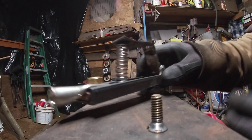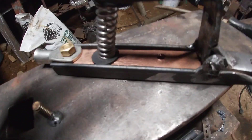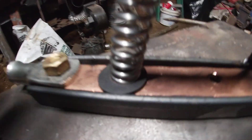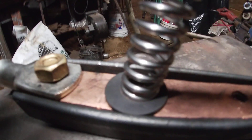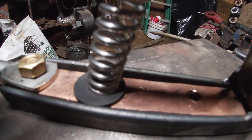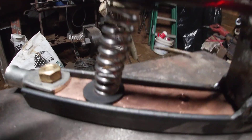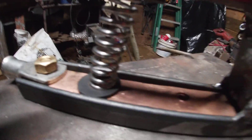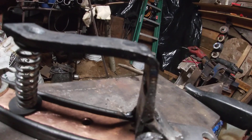The guts of it are very simple. I used quarter-inch rubber washers for the spring. The spring is 302 stainless steel, quarter inch by one and three-quarter, 12 gauge. The handle was just an L-bracket that I bent to shape.